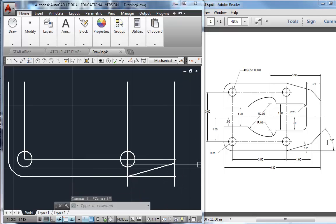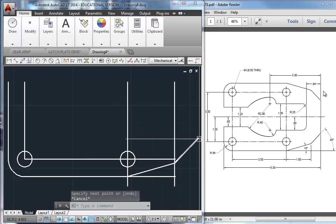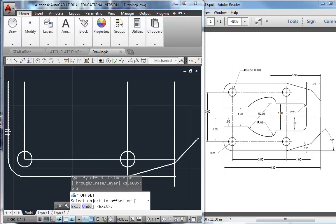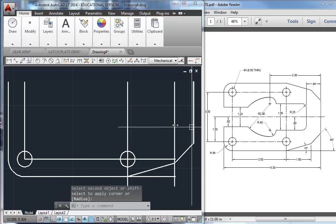The next line that goes up is going to go up at a 45-degree angle. Again, I don't know where it ends — I just know it's 6.3 from the left edge to the right edge. I'll pick this end point and go angle 45, take it out there some distance. Now I want to get this end line — offset 6.3 from the very left edge over. And there's the corner of the part. We could zero-fillet that: fillet radius 0.